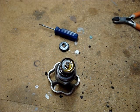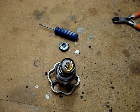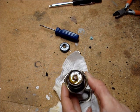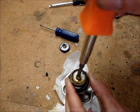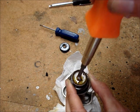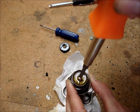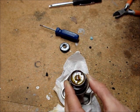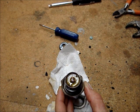Some people like to use WD-40. However, an oil penetrant works better at getting rusty or stuck bolts free. Gently tap the top of the bib screw — sometimes this helps the oil penetrant get down along the sides of the screw. Give the oil penetrant a little time to work.